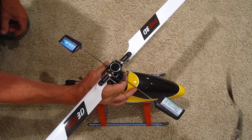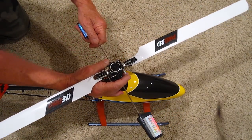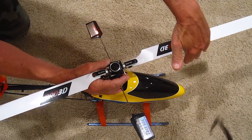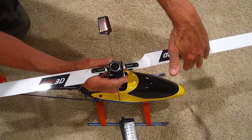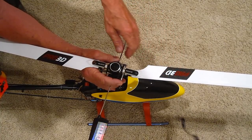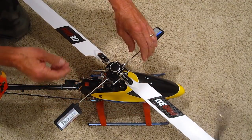The rotor shaft and head is being turned by the motor, and as it comes around into the wind, the wind pushes on that blade slightly — depending on the amount of wind — and bends it back just a little, as it's trying to turn it into that wind. Once it gets completely on the other side, the centrifugal force will hold it out again.